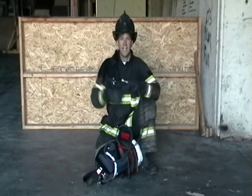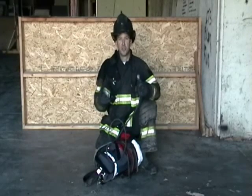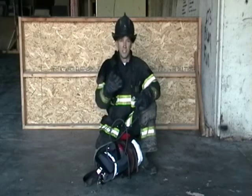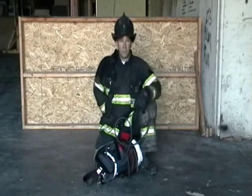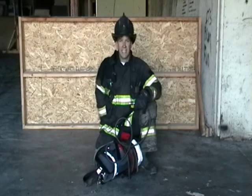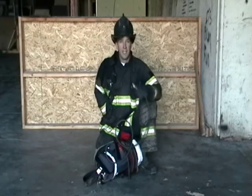So the RIC UAC is a transfill. It's a high pressure braided hose used to transfill to the downed firefighter, and we'll demonstrate that evolution. Problems with the RIC UAC. When the RIC UAC and the downed firefighter's pack, those caps come off, dirt gets in them, drywall debris gets in there, that RIC UAC can become impacted.